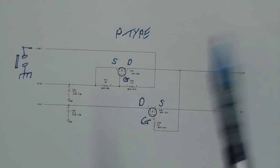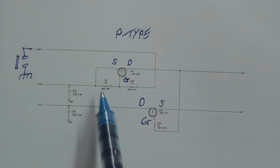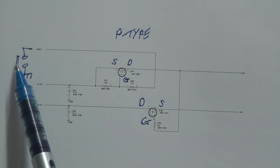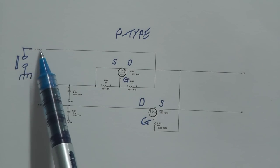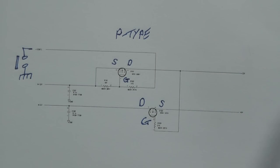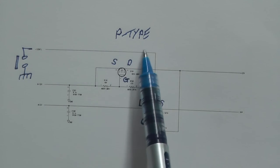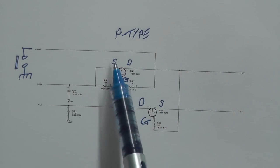Right, we're getting somewhere now. This is a schematic for the power on circuit. It consists of two FETs and a few resistors, and they're mounted on the passive backplane. So you've got the power switch there on the front panel, which I've drawn on. It's normally open and it's grounded. And you've got a signal here, plus 12 volts control. These two here, the plus 12 volts coming in, the plus 5 volts coming in, those are direct from the power supply. The plus 12 at this side and the plus 5 at that side is what goes off to the CPU board, etc. So, with the switch in the open position, this line is basically floating, but this resistor here pulls the gate towards the source, therefore the FET is turned off.